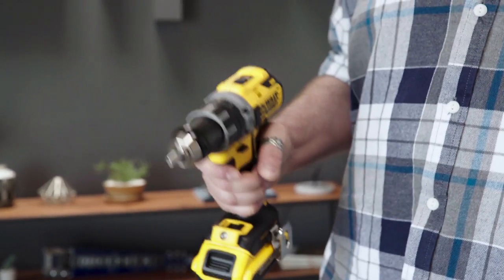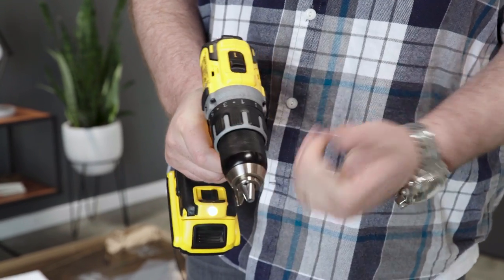When you're building Platform, we highly recommend that you use a drill. However, when using a drill, be familiar with the clutch. What the clutch does is it keeps from overdriving the screws into the side of the desk. You should really just start with a low setting and work your way up to when the driver drives the screw in flush against the side of the desk without denting it.